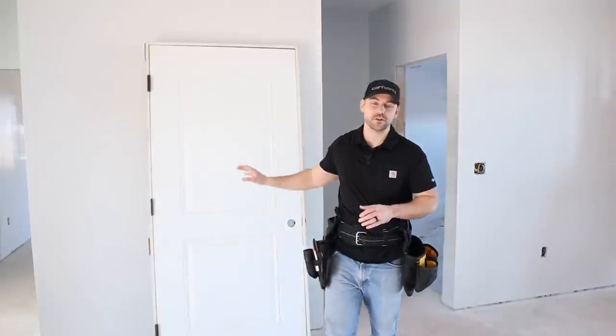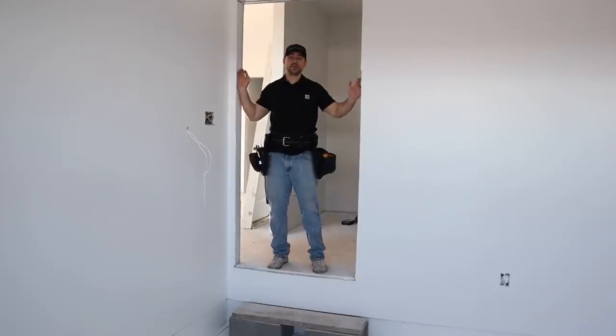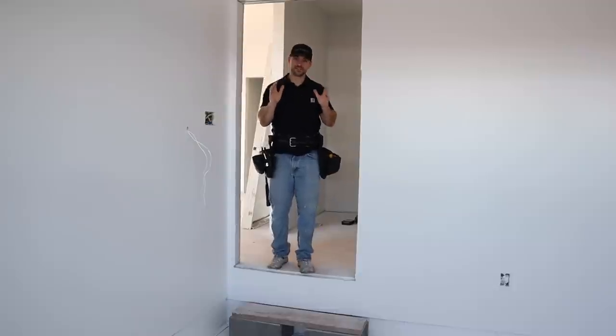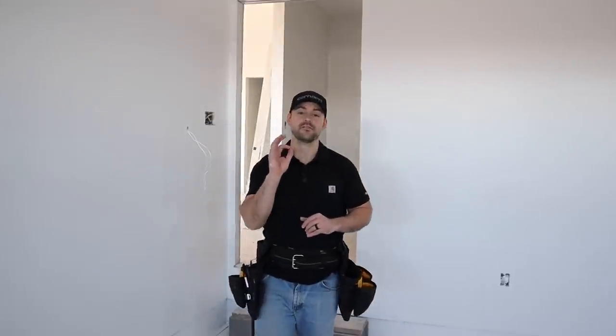In this video I'm going to show you how to install a door. My name's Josh — this channel is all about building your own house and saving a ton of money, so subscribe and ring that bell for notifications. The door in this video is a fire-rated door for the opening between the garage and the inside of the house. Because this is an attached garage, my jurisdiction requires a door with a 20-minute fire rating — a standard steel exterior door won't cut it. The drywall on the perimeter of the garage also has to be fire-rated.